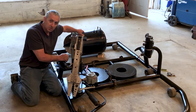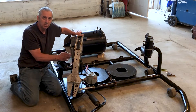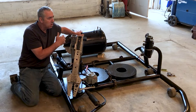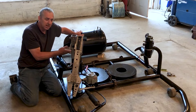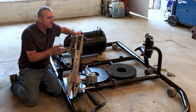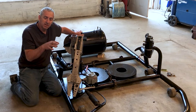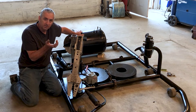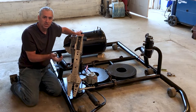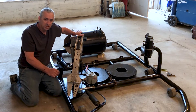The battery pod actually attaches to the submarine sphere. It does that because I want some weight on the submarine — if I drop the chassis, I don't want the submarine to be so light that it becomes inverted and goes to the surface. I want to maintain enough ballast weight so it stays oriented in a vertical position.